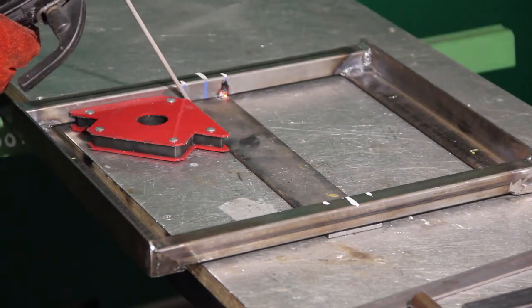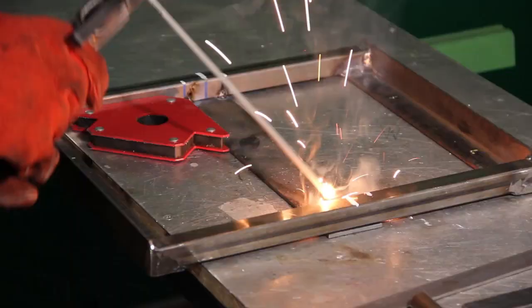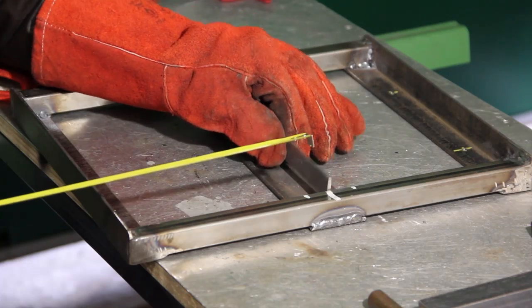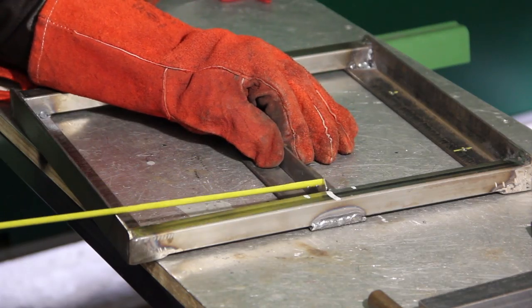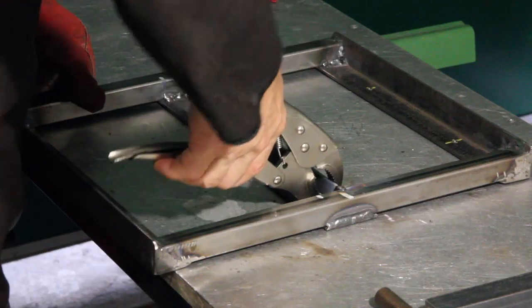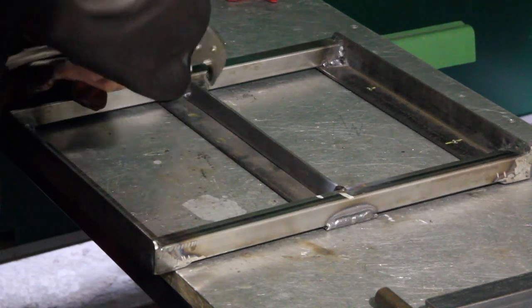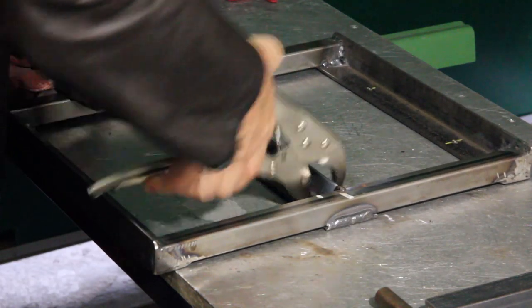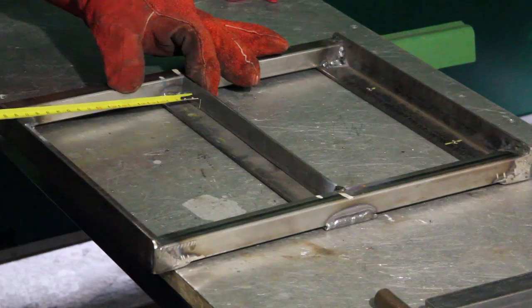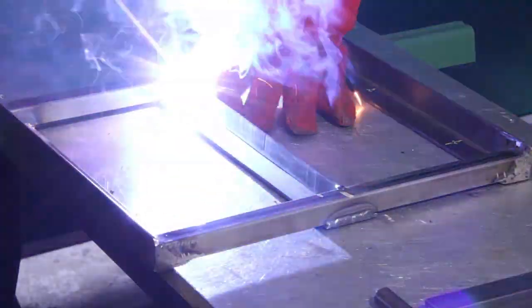With a 40 by 4 mm flat bar, the bottom side of this upside-down T is welded. This will be the central support between the two batteries. Another 20 by 4 mm bar is also welded to complete the T and will become the divisor between the two batteries. Only a few millimeters of gap are left, so this work must be decently precise.